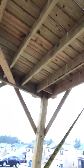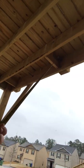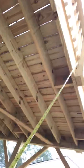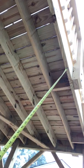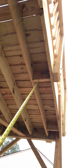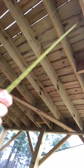What I want to note here are these additional blocks for your guardrail, your outer guard post. Code wants these exterior blocks in, because instead of having your outer guardrail pushing all the weight on this band right here — which acts kind of flimsy — when you add a block here, it now ties your weight back into this band, which is then tied down by all these boards.